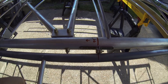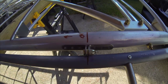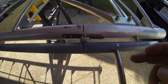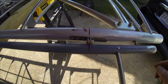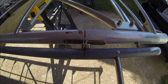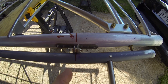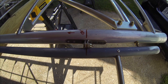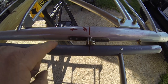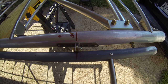Same thing down here — we've got another bolt to contend with, so I put it right here at 94. Down on the end we've got a bolt and another rib that would impede us, so we moved it over to a reasonable distance from where the aileron bell crank is going to hook up. You'll notice I have these hinges bolted together with washers in the middle to space them apart. Per the plans, two of them need that space to receive the other side, which will be inserted in. I use the bolt and washers to hold everything together nice and straight.